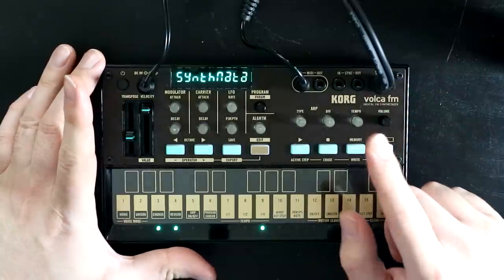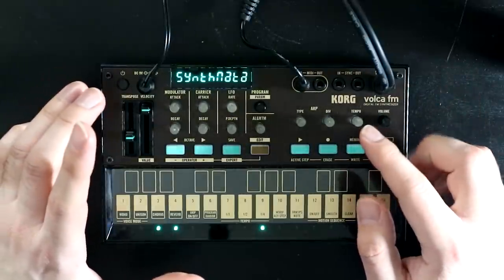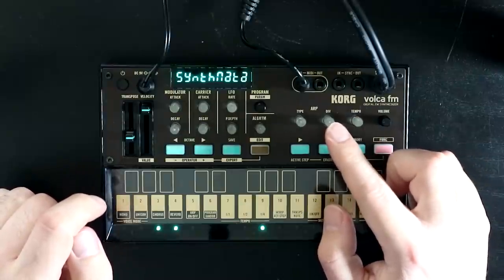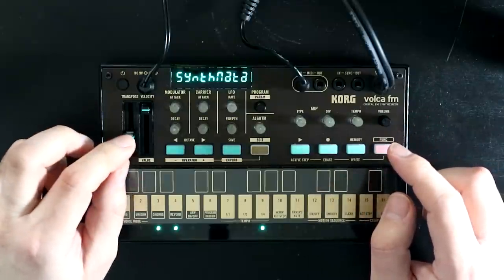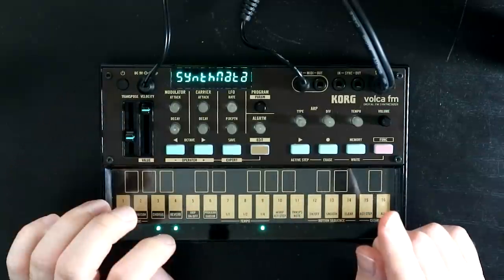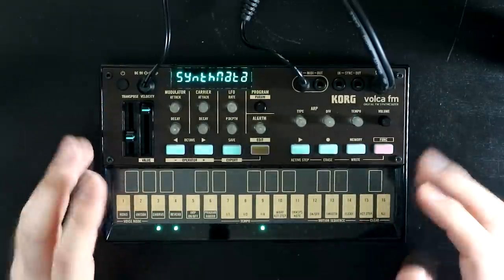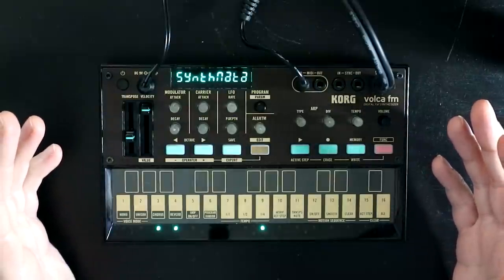Just a couple of things related to MIDI. First, if you are eagle-eyed, you will notice that the full-size five-pin DIN MIDI input is now gone. We are now working with MiniJack MIDI connections, but we have now got a MIDI in and out. The MIDI out transmits all of the knobs and sliders, transmits clock, and transmits note-on messages which are affected by the velocity slider. It doesn't, oddly, transmit the arpeggiator — which is a shame. So if you turn on the arpeggiator and play a chord, you just send the chord. Perhaps that will be changed in an upcoming firmware.